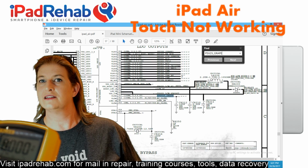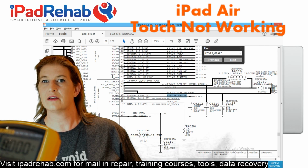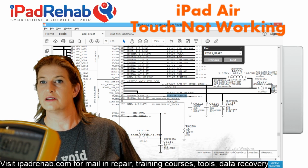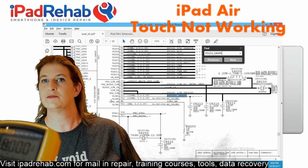So it is in the screen grape section, and we've got a bunch of different power rails that all have to do with screen or touch. This is one of them. So PP5V25 is a PMIC output.